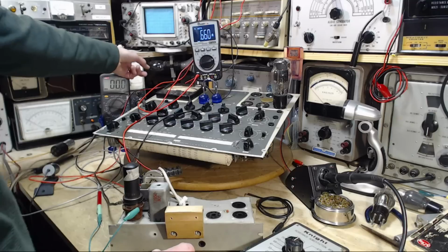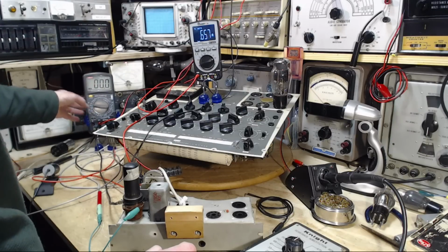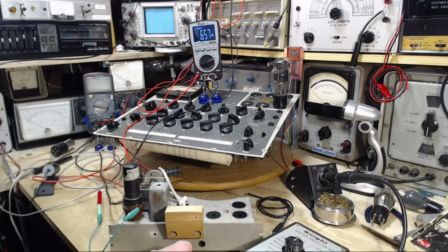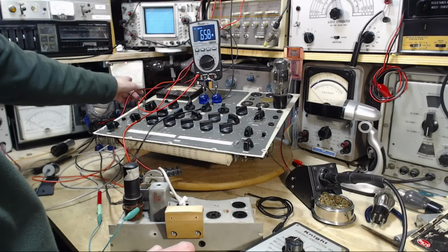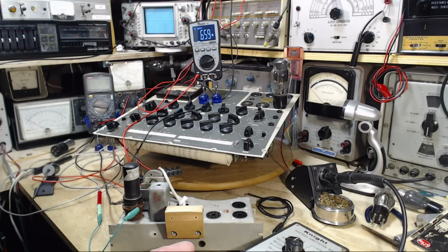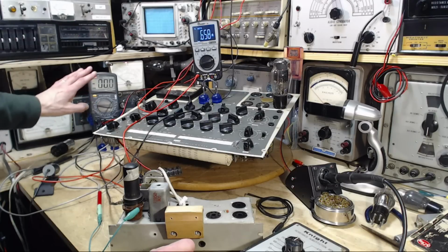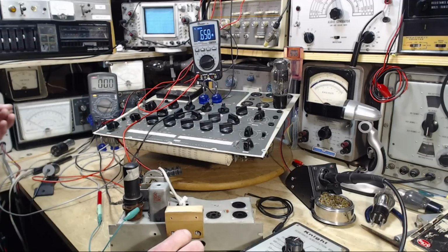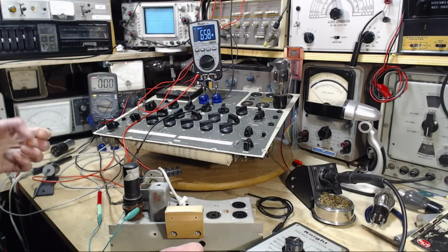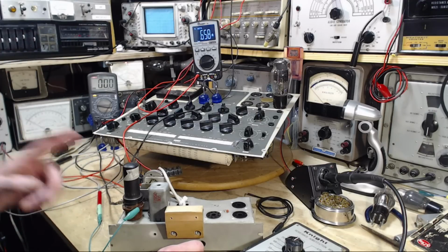Okay, plate voltage is going to show up here. Let's remember this now. The plate voltage we're shooting for ultimately was 250, I think. So I'm on the 150 scale. For now, we're going to bring it up to 150 to start with. And we're expecting at 250 a C minus of 16 volts. I haven't got a C minus meter on here. Do I? I do not have a C minus meter right now. But I did set it. It's still set the way it was.